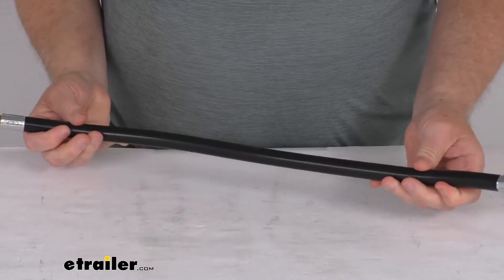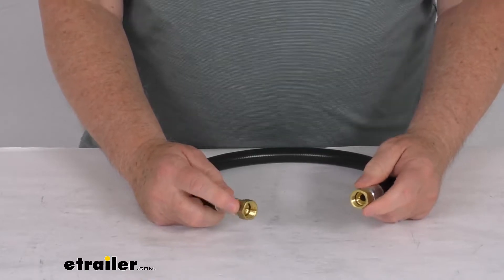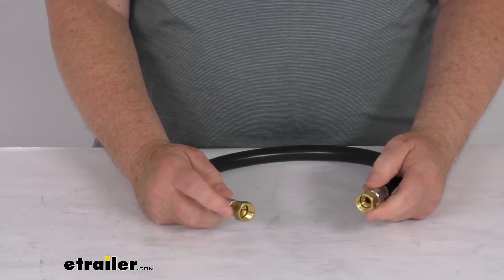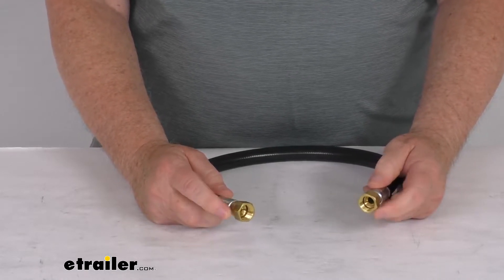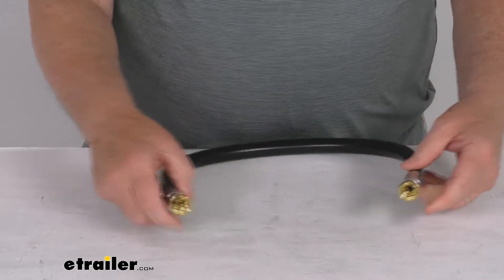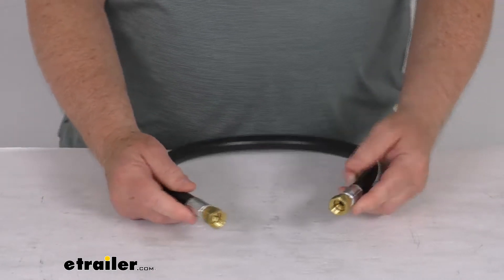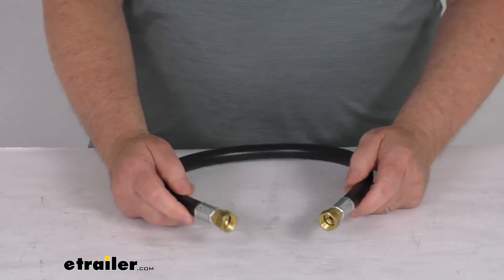The length on this is 24 inches long. On each end it has the 3/8 inch size female flare swivels, and the wrench size used to tighten those down is 3/4 of an inch. It's a thermoplastic construction — that's a plastic polymer which will become more soft when it's heated and hard when it's cooled.